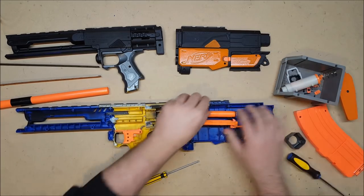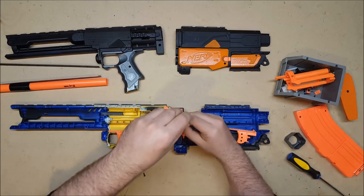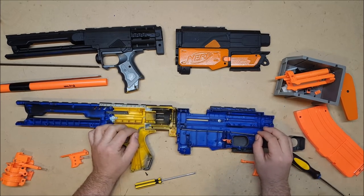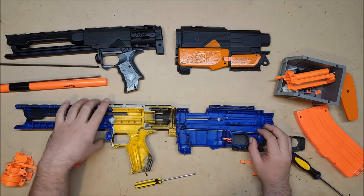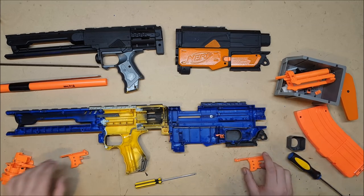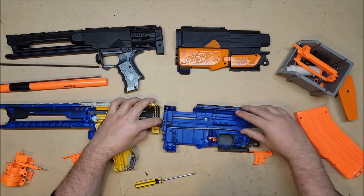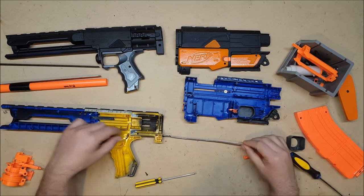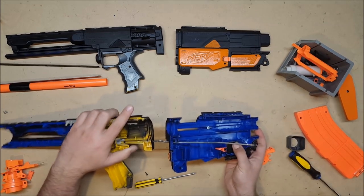The trigger linkage between the two triggers is all internal, and that was by far the hardest part of this project — I spent a long time getting it working properly. Linking the two triggers is a steel rod: I drilled holes, and it goes on the outside of the barrel extension, back into the Recon, and down under the structure, which required a lot of dremeling to fit, and a lot of tweaking and bending to get it sliding smoothly enough that the trigger springs have enough power to push it back. The rod can be partially removed for cleaning or adjustments and slides back in.